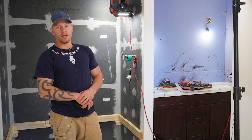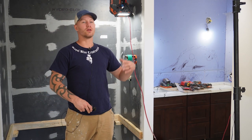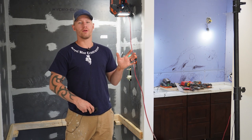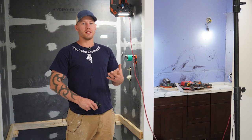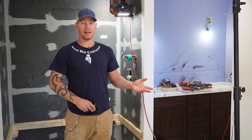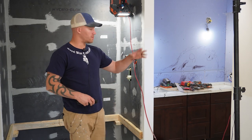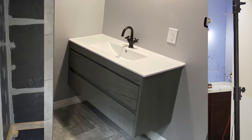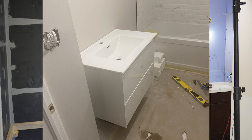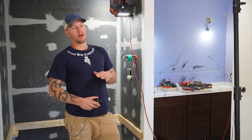Another feature to think about is your vanity. There are a lot of styles and the cost can start around $150–$200 at Home Depot — the sky's the limit; the most expensive one I put in was a $7,000 vanity. Two options: you're going to have a full unit, or a floating vanity that hangs on a French cleat. They're pretty common now, sleek, and allow a bit of storage underneath. One thing to factor in with kids: you will be cleaning underneath a floating vanity — guaranteed.